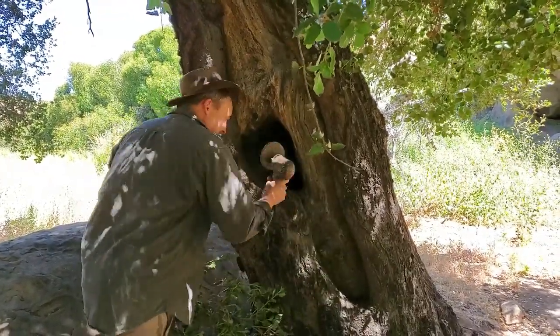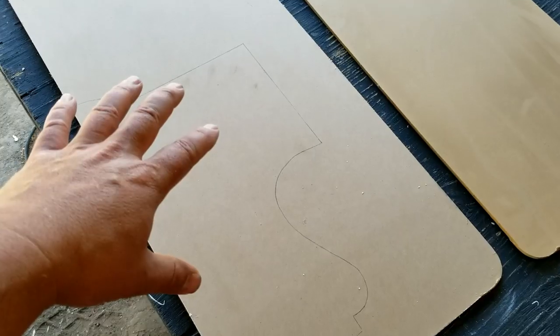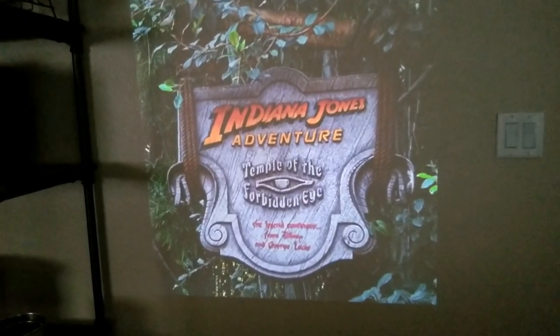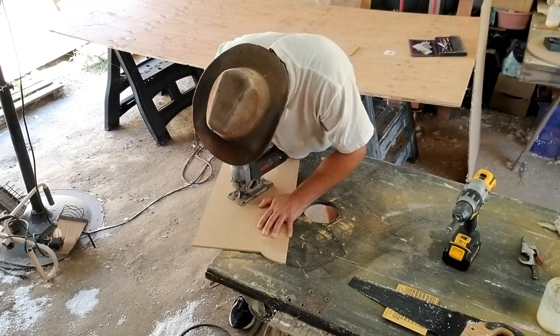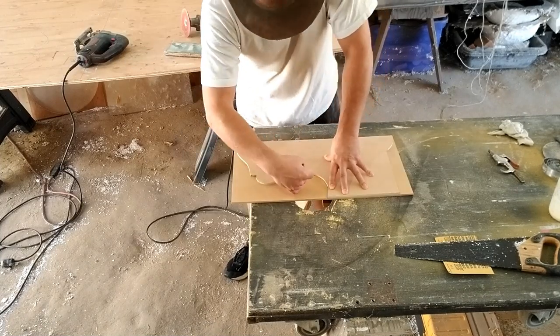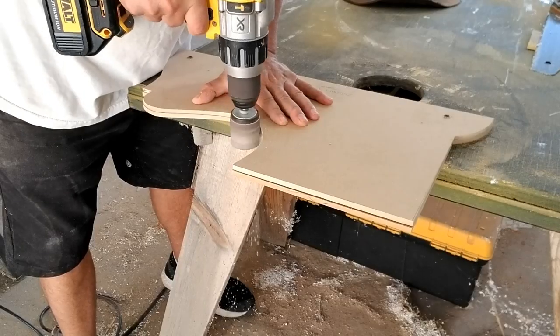After doing some searching around for some lost tools, I started making a template using a couple scrap pieces of 1/4 inch MDF. I used a projector and traced the overall shape and text onto paper. Then I sketched out one side of the sign on the MDF and carefully cut out the shape and cleaned up all the edges real nice. Then I used that piece to trace around and make a copy. That way I had two halves.